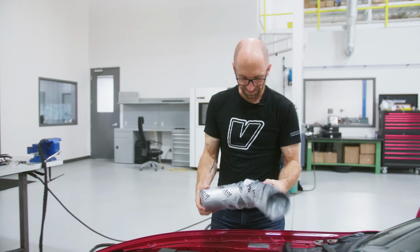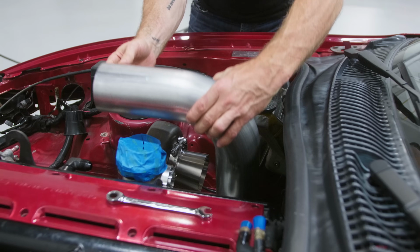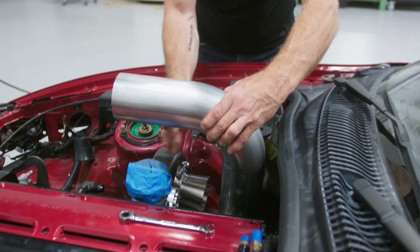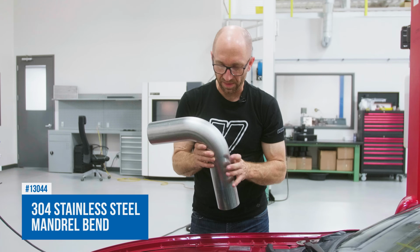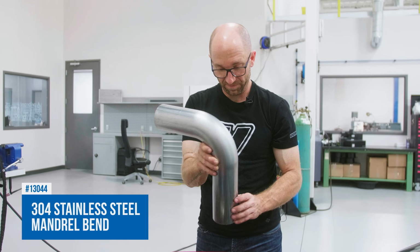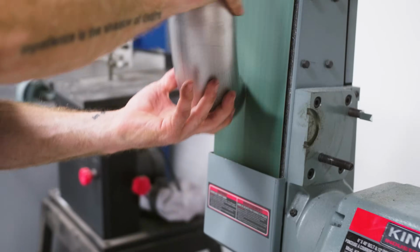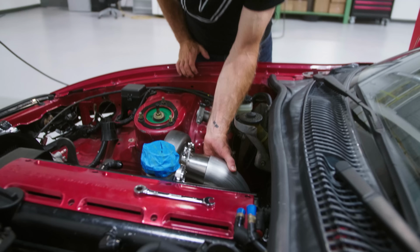Our 3.5-inch bend, I'm gonna cut this really close to the tangent point on that bend where the leg starts. Lots of clearance to the firewall behind it, probably shorten it, and then I'll add that other half of that cone to get it back up to 4 inches there. More cuts. And our leg is completely gone. Oh, that looks great. Lots of clearance everywhere.